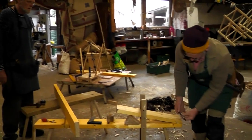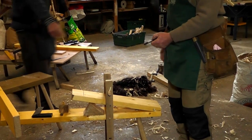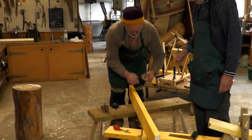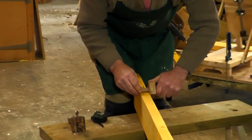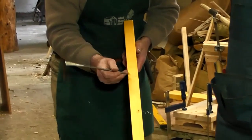This hole here I find works best with a 14mm bit, but we're not yet at the stage of making the tongue. So, guessing which is the halfway point, with my marking gauge I do a scratch line and another scratch line, and the 2 lines are a little bit off, so we then just take the visual average of the 2